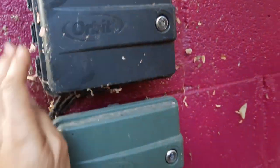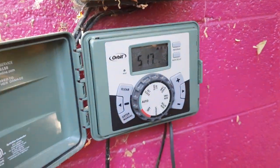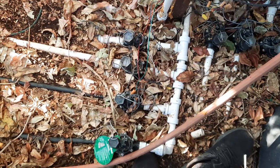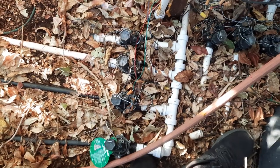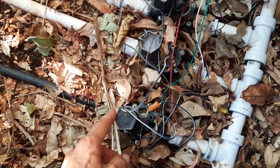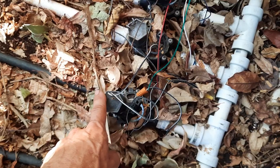This is the part that is going to operate all of your valves. And your valves are these parts that I showed you earlier, these parts here. And you can think about these basically as like a knob for a hose. So all these do is turn something on and turn something off. And they've got two wires that come off of each one of these valves. They come off of this solenoid, which is this top piece here. And all they do literally is turn on a hose and turn it off. So that's the easy way to think about this.